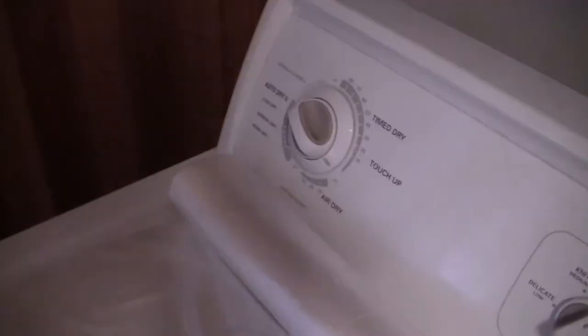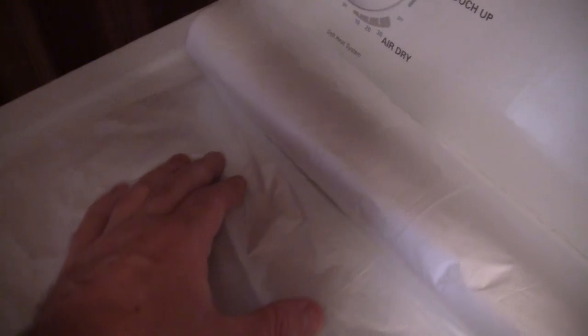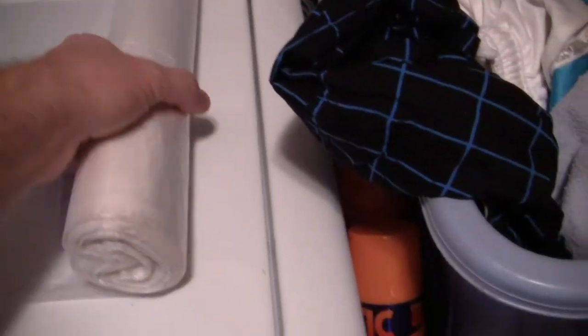The trick with the corner is it's hard to do with two hands. Let's say you put an extra foot for the corner. If you don't, your plastic is going to bow out like this — it won't go straight to the edge and down. So we give it an extra foot here. Now we turn the plastic and we start from this edge right here and go all the way across. You can do this with two hands, but I can't do it with one. We'll go all the way across.